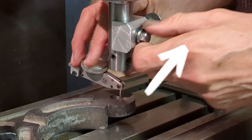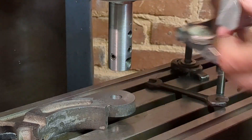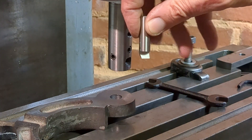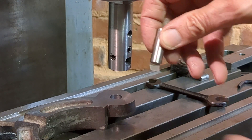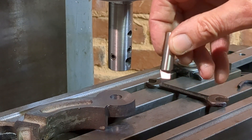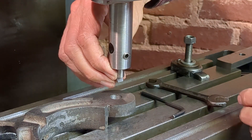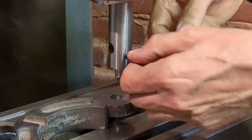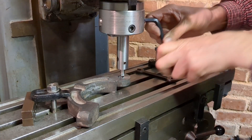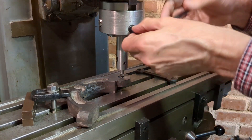If you want to see more details on the construction of this DTI holder, there's a link here. I've made this cutter from a broken end mill and that should enable us to get in there and counter bore the hole — it's going to be three quarter inch diameter. This is square across the end, so we should be able to use this boring head to counter bore. To begin with I put very small cuts on the boring head, but with practice I discovered I could actually take quite large cuts.